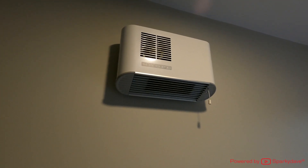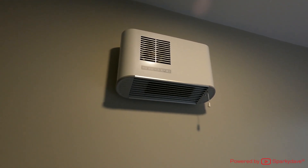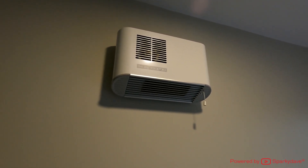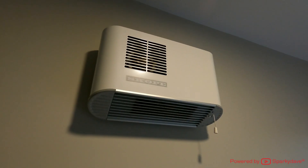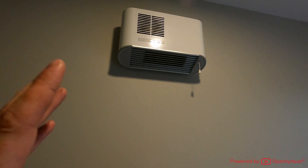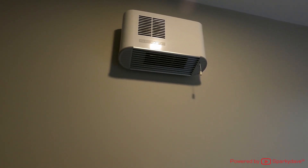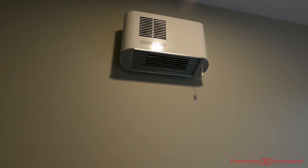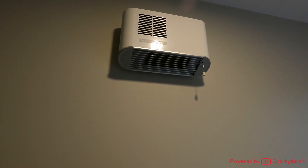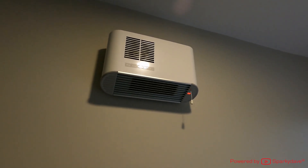For the first part of isolation, I'm going to turn this heater on in the bathroom and leave it running while I go to the switchboard and turn circuit breakers off until I can confirm that I've turned the right circuit breaker off. I'm lucky this heater is still operational so I can still hear it outside of the room, which will make identifying the circuit breaker a little bit easier. I'll turn it on now and go to the switchboard.